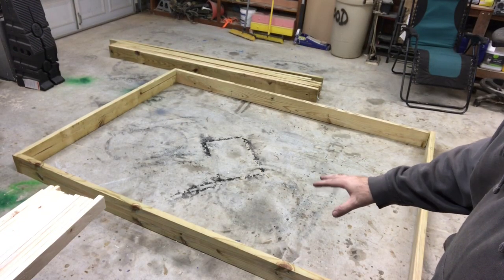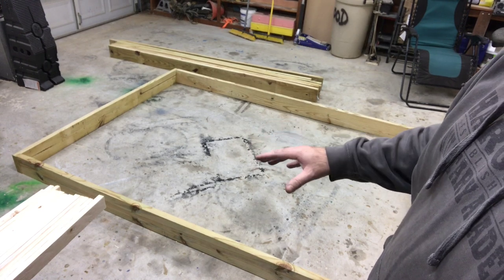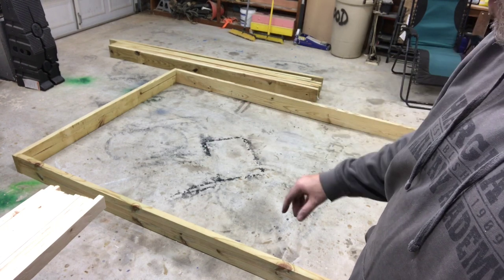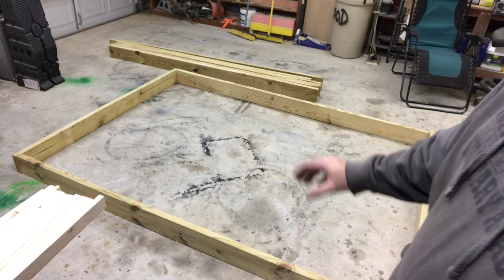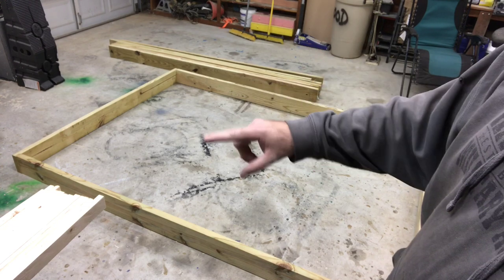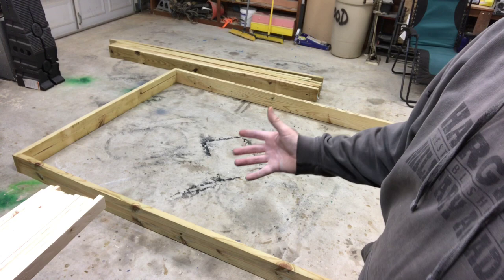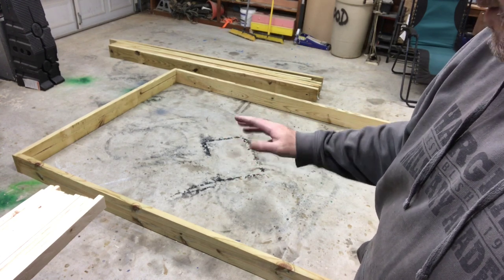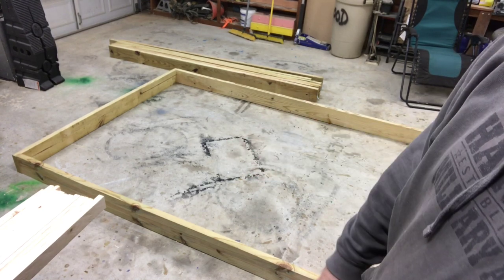What we have so far: I bought two by six by eight foot treated lumber, and this is what we're going to use for the floor base. I'll run the two by sixes in the center and use OSB for the floor and panels. We've got this squared out and we're going to start screwing it together, then figure out the cross braces. We're going to run them with joist hangers, but we're also considering a trap door, so we have to figure out how to handle that.